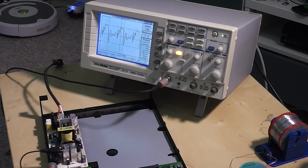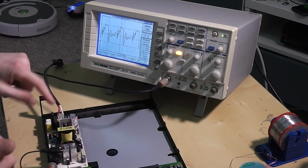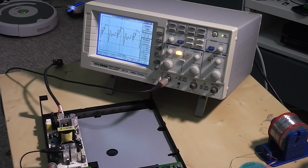Before I switch out the capacitor, I decided to take a quick look at the kind of voltage range. I'll see what's going on on the oscilloscope. I've hooked up a probe basically across the capacitor, and I've achieved that just by attaching to a diode and the heatsink of one of the voltage regulators, which is grounded. And I've got a trace up here.